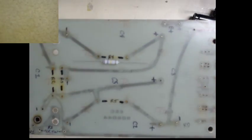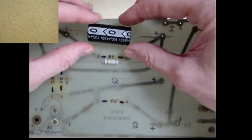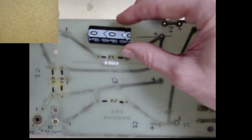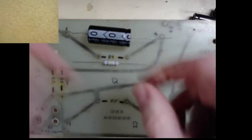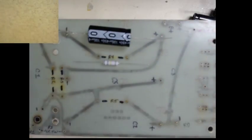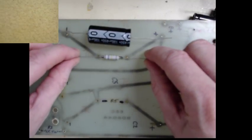Now, what about vertically? What about vertical parts? Vertical parts should read from top to bottom. So that way, when you're looking at your board, and you have a mistake in there somewhere, you want to be able to not have to flip the board around all over the place trying to get all your parts in the right orientation. So that'll help you put these things together.